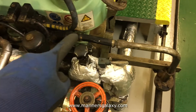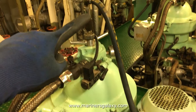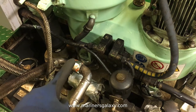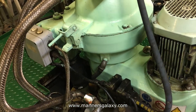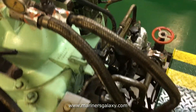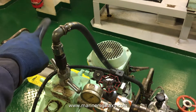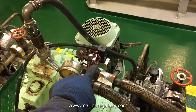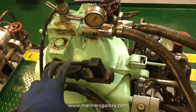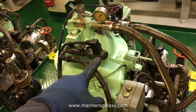You have the water line. The only difference you can see is that the water monitoring sensor is missing because this is just a lube oil purifier. Most other things are similar to the HFO purifier. This is the inlet pipe to the purifier with the pressure gauge, this is the operating water inlet, and then you have the outlet with the outlet valve for pressure.